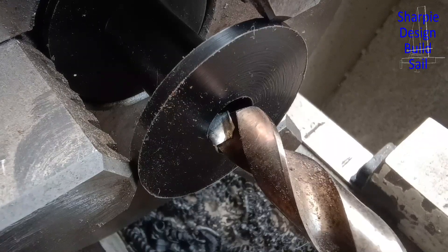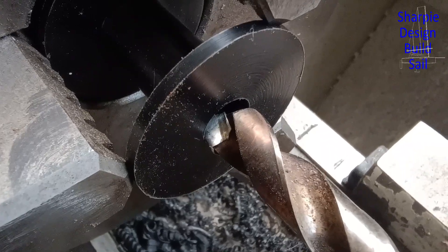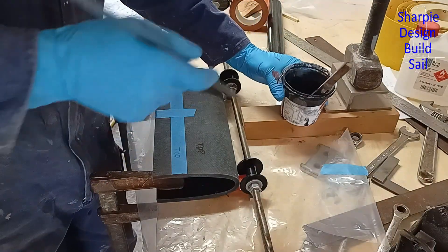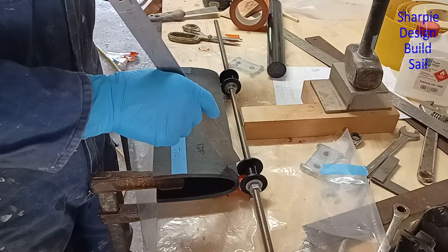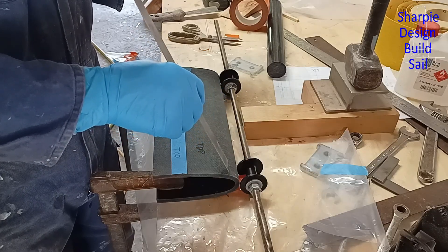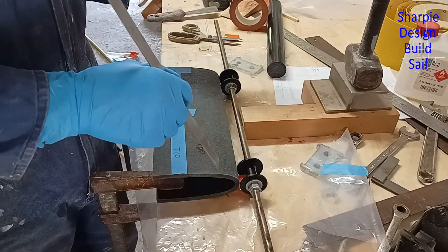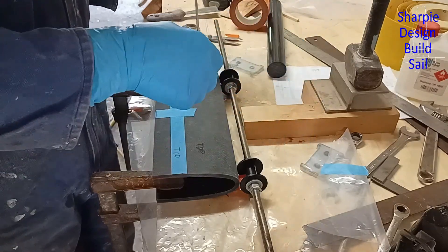How do you make a drill drill slightly oversized? Shim one flute. I tried it on the other one and it worked — it's the first time I've ever done it. To be honest, I've struggled with what to do here — how to integrate these bearing bushes made out of Delrin or acetal with the rudder housing. I've thought of so many different ways of doing it. I'm going to layer in some epoxy over the afternoon and get it to a point where I can hopefully tomorrow lay some carbon around it.